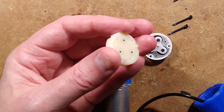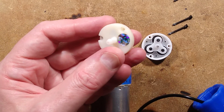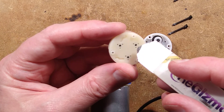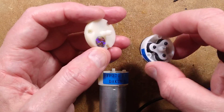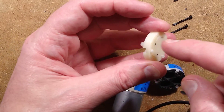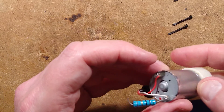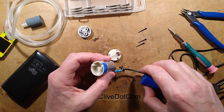I shall explore that afterwards. Let's see if I can pop this off. I think it is staked into position. I think the screws only go down to that lower bit and I don't think this top bit is going to come off - I think it's glued. But I think I can see already: it is just basically little pinned flaps with an air hole either side, so it can push air out through there but can't return. So it's pulling air in through these flaps into this area, and when it pushes back out they close and the other ones open. Because it's rotating, it is a continual flow from three little air cylinders. It's quite neat - it's very simple and clever. It's a very standard type of air pump.